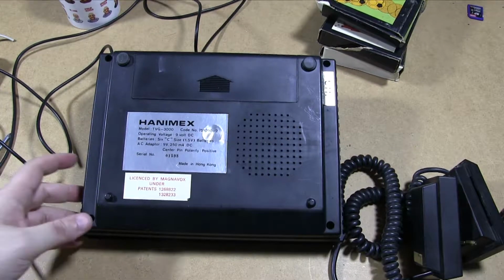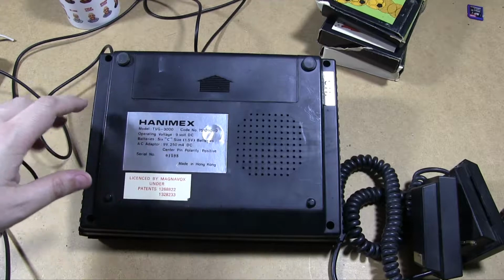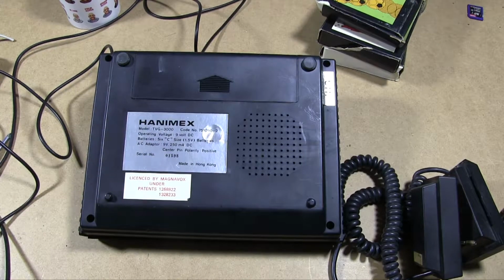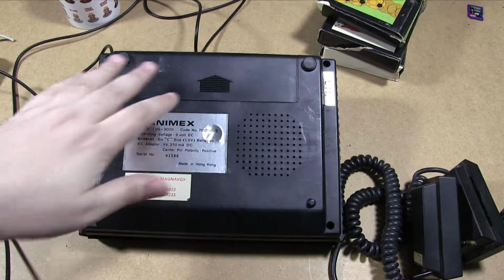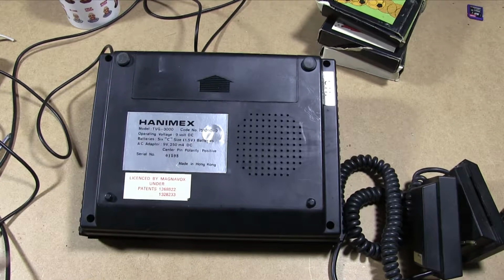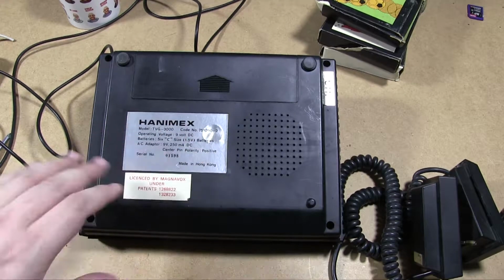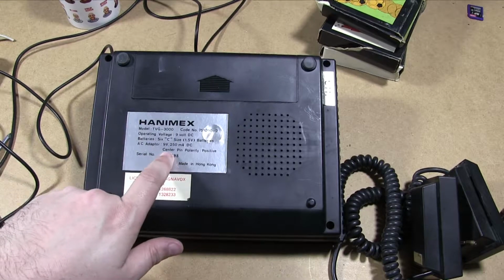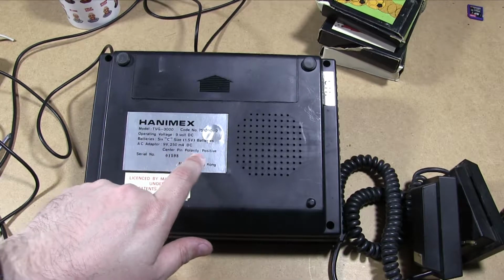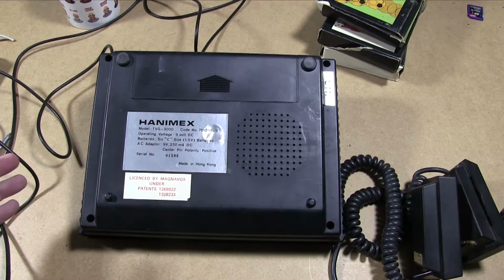Okay, I was just checking we'd released enough of the screws. We have. So before we open it up fully, we take a look at the back here, because something I obviously missed: it can be powered by batteries. Most of them could, of this era. In this case it's 6 C cells, and we have this lovely big silver badge here. We're going to look at how we work out the polarity of the power supply, but it doesn't actually tell us in this one. So, center pin polarity positive. That's pretty standard for a European machine, to be honest.